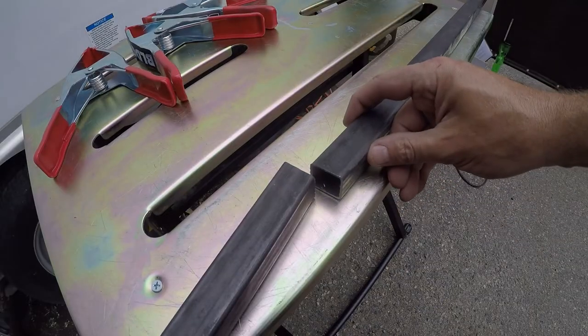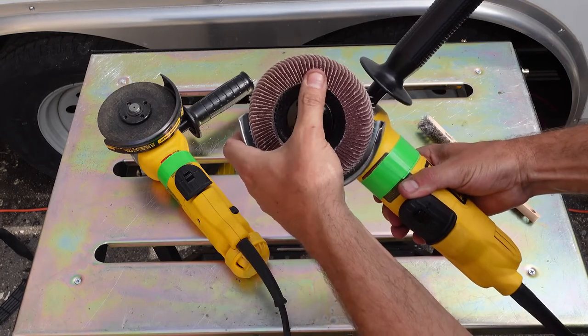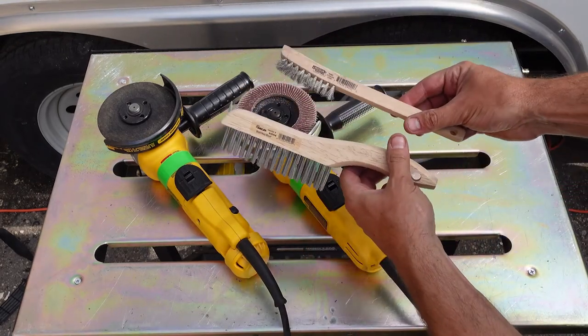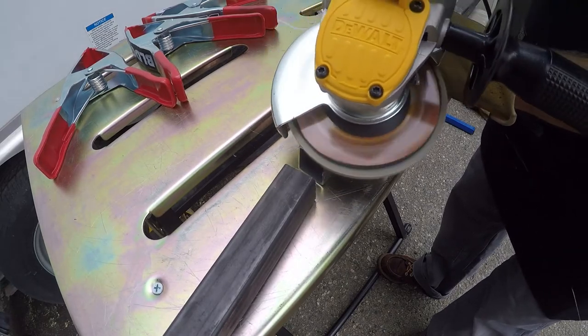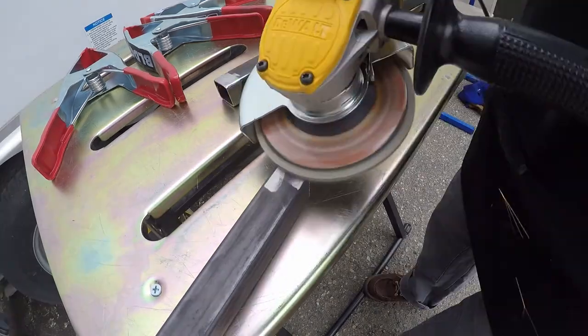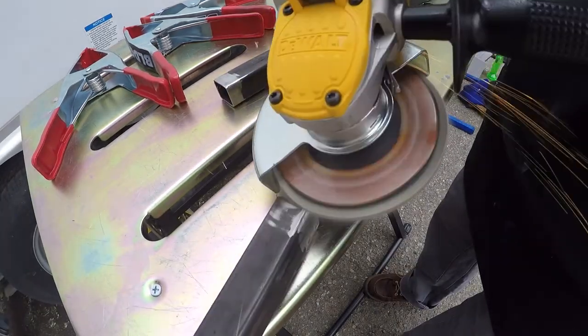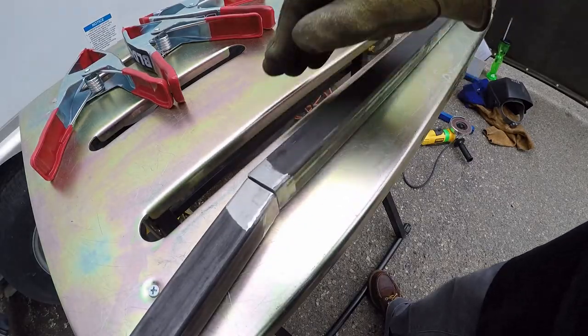When your material is painted or coated in some other way, it is important to clean it down to bare metal. Whenever welding, it's always handy to have an electric grinding tool or steel brush. Occasionally, we need to clean grease or oil off stock material, even when it's brand new. Welds will only reach full strength if we work with rust-free, clean, bare metal. At Building 61, safety is first, third, and fourth priority. The second is coffee.